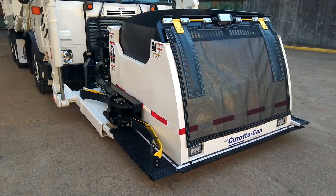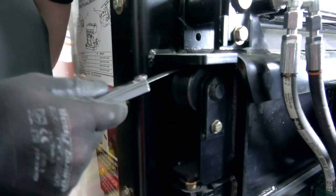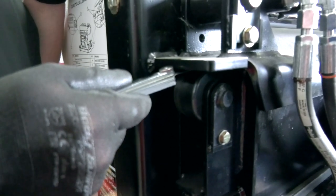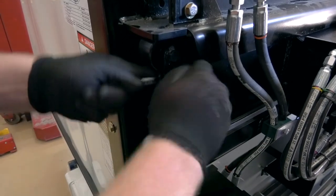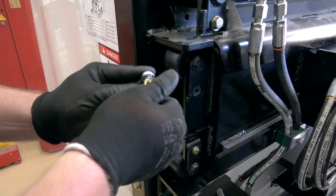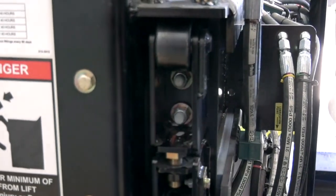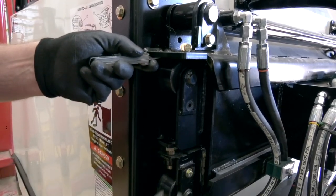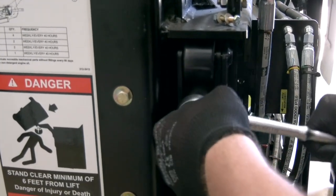The following is a checklist that you should perform every month or 200 hours of operations. First, lower the Ker-Auto-Can to the ground. Then lock out and tag out the truck. While the slide is fully retracted, grab a set of feeler gauges and check the gap between the top slide roller and the slide track. The distance should be adjusted to 15 thousandths of an inch. If you find there's an adjustment needed, first remove the slide roller pin retaining bolt with a 7/16ths inch socket and ratchet and a 7/16ths wrench. Then loosen both slide roller bearing lock nuts with a 3/4 inch socket and ratchet. Now you can make the necessary adjustments to the slide roller bearing adjustment bolt with a 15/16ths inch wrench. You will want the feeler gauge to slide between the top roller and the slide track with slight drag. When finished, tighten the lock nuts and replace the retaining bolt.